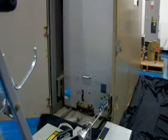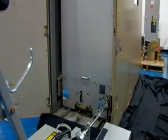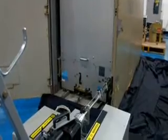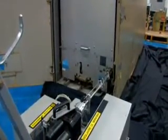Even with personnel wearing the proper personal protective equipment, if an accident occurred while manually racking a circuit breaker, the operator could still be severely injured. The Square D Services remote rack removes the operator from manual contact with the circuit breaker during racking, reducing the potential exposure to an arc flash.